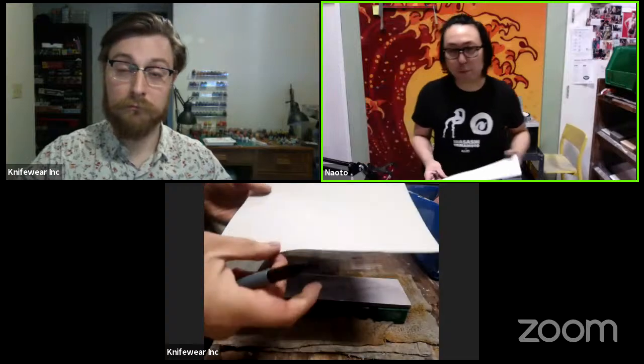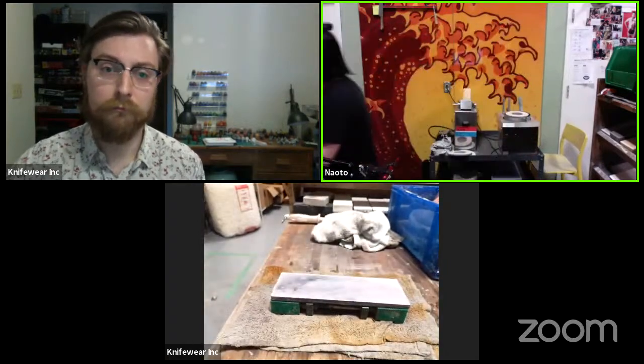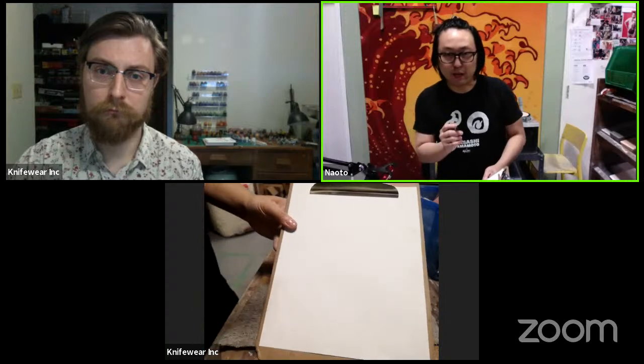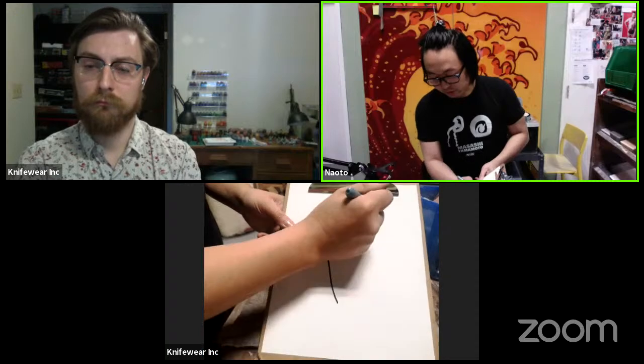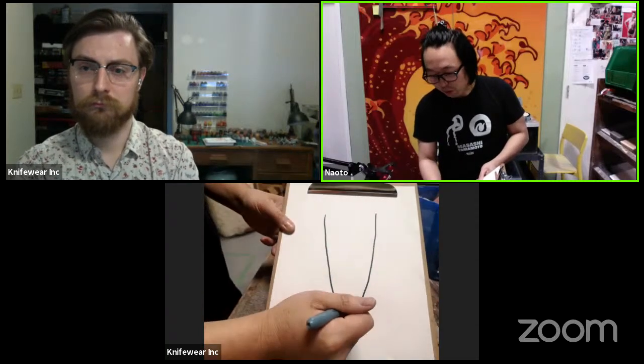what I have seen is that, for example, when I have a knife that has been chipped or sharpened wrong, the edge needs to take quite a bit off. So it tapers, but because it's chipped or for a lot of reasons, I needed to take this much off, and I want to bring that edge back.